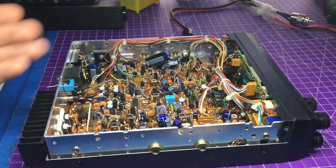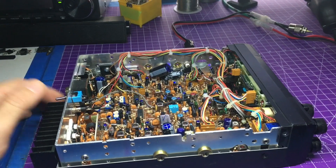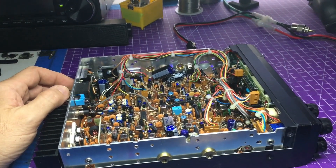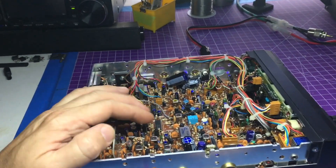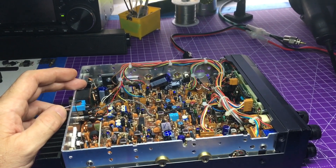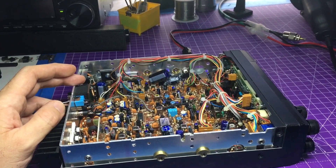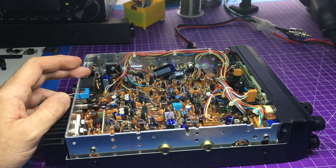New guys get spoiled with the Striker 955, because it kind of has everything in the box that we had to deal with in the 80s, 90s, and 2000s to get it that way. The old PLL-02A chip will still live in infamy as the best freaking chip — mass produced. A clip of wire and snip and boom, you're gone on the upper bands on so many of those radios produced with that.